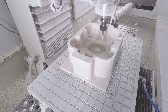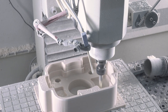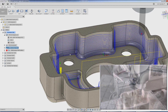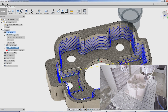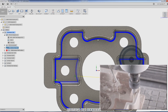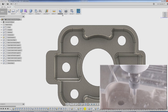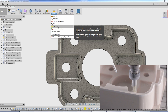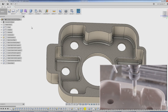Last but definitely not least, we're switching to a Lakeshore half-inch ball end mill, and I'm doing a contour operation which is walking up this inside wall as well as handling the inside fillets. The fillets are, I assume, more cosmetic and for avoiding stress risers in the casting. The inside wall is important because that's what handles your taper. Fusion does have some pretty cool tools when it comes to inspecting draft analysis — it can actually help you understand if you've created the correct draft when you pour a casting to be able to successfully remove it from the mold or pattern.